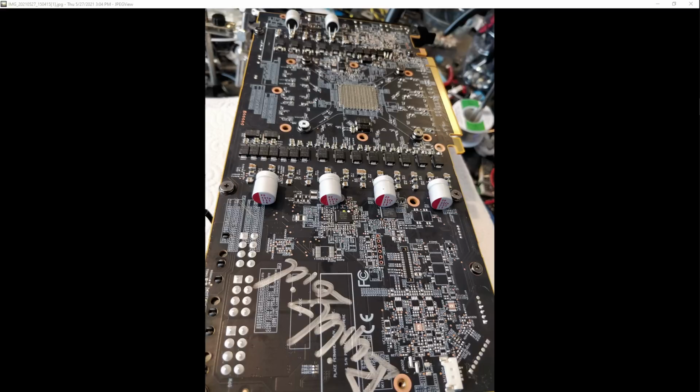The problem with that configuration is those caps are gigantic. They are 10 millimeters in diameter, and I don't want them on the back of my 1800 quid card. They're way too big. There's also not really anywhere to attach them properly, so they're just kind of hanging off of the multilayer ceramics, which is super sketchy. If you grab the card wrong, or forget about it and put something on top of it, you're probably going to break the tabs off of a multilayer ceramic with caps that big attached to them. So that right there is totally not okay.